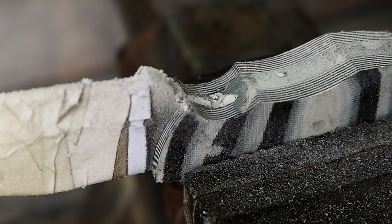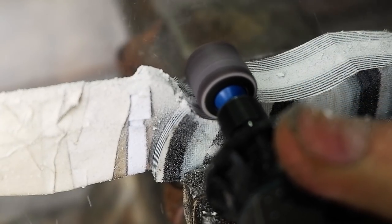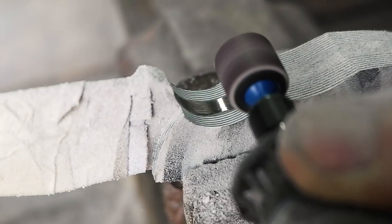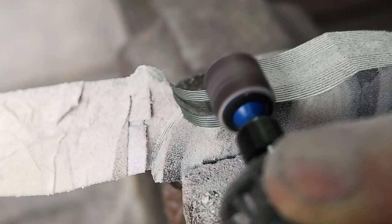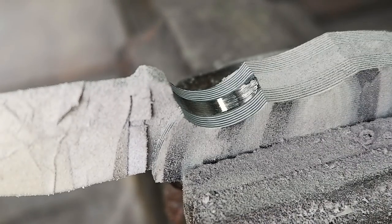Use a rotary tool with a small drum sander to clean out the finger choil and to grind in the texture into the scales. Once again, you can decide whether you want to add a texture or not, but with the black and white contrast in the pattern, it's hard to resist. Finish off the scales and the blade to its final shape and finish.